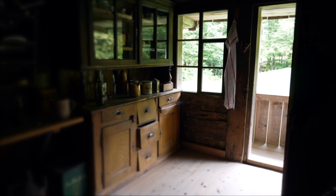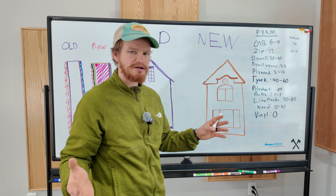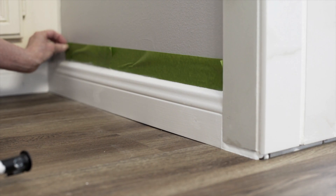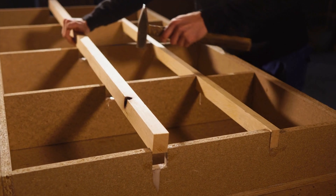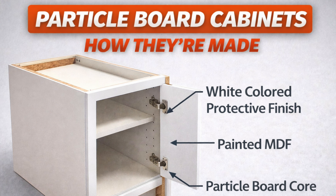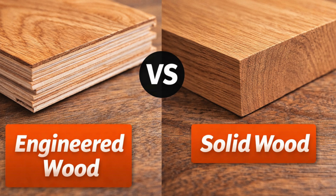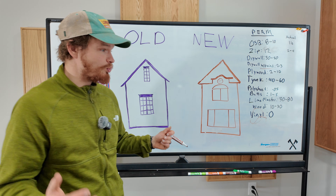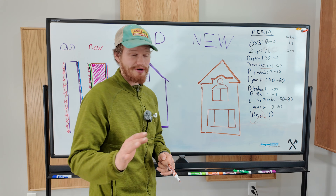For finishes in the old house, we've got natural wood trim, natural wood cabinets, natural wood floors — it's all just solid wood. Whereas in the newer house, we're going to have synthetic and engineered products everywhere. What looks like wood baseboard is oftentimes MDF — medium density fiberboard, ground-up wood particles glued together. For cabinets, we'll have low-density fiberboard, also known as particle board — very similar, just lower density. For wood floors, even if we have real wood, a lot of times it's over an engineered or plywood backing. An engineered wood floor is not a bad product, and it's definitely way better than having a laminate or vinyl floor. Vinyl floors are literally the worst you can have.